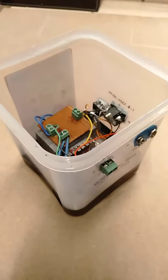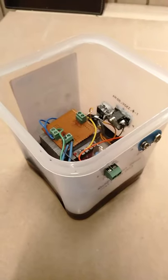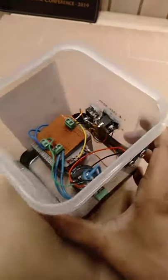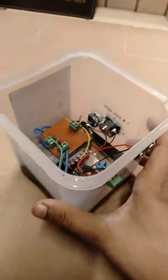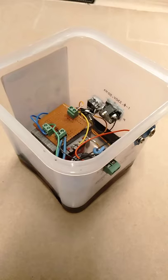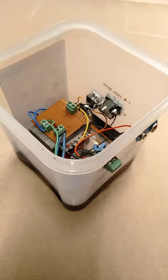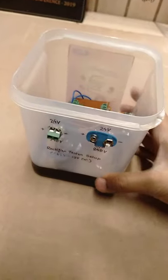I've been asked why use SMPS or an adapter instead of a rectifier. This is a rectifier circuit and it weighs around 700 grams for a 2 ampere supply at 24 volts. Overall, this is a 48 watt power supply with the output being DC. Here is the AC side of the circuit and here is the DC side of the circuit.